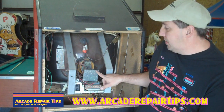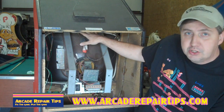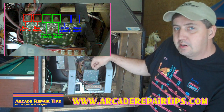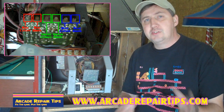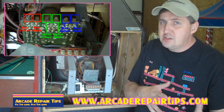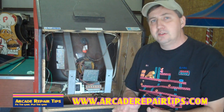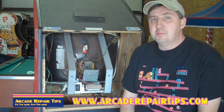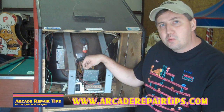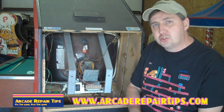A lot of monitors will have adjustments up here or on the side of your neck board. The neck board is the small board that attaches to the neck of your tube. Up here you'll have the red cut-off, the red drive, the blue cut-off, blue drive, green cut-off, and green drive. By your color wheel, a combination of those will sometimes give you different colors, so you need to adjust those. If you've got too much red, you can turn the red drive down. There's no scientific method — there's no certain way to do this except to get in there and turn some knobs. If you want a little bit more red, turn it to the right; a little bit less, turn it down. Play with your colors enough and you can usually get a really good picture.